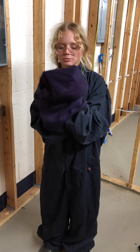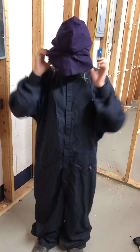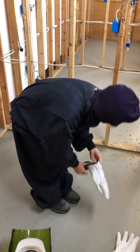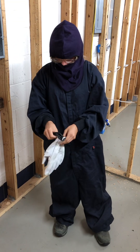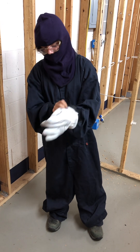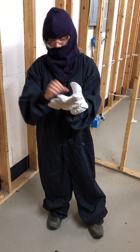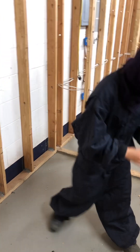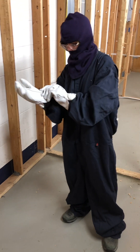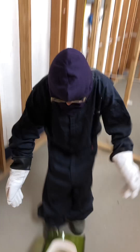On an exposed panel, there's a work zone where you need to have the arc flash suit on. It's to protect you from arc flashes that may occur when electricity jumps from conductors to complete a circuit — and when that happens it's kind of like lightning. It's not good for you; it could kill you. So that's why we protect ourselves.